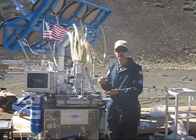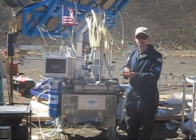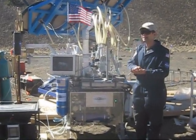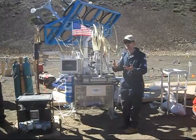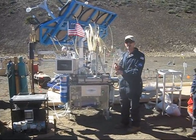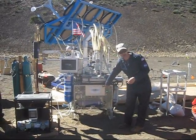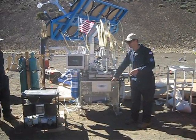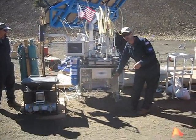We're not just heating the soil — the trick is you need to do that in a methane gas environment. The methane is carbon and hydrogen. When the methane hits a hot enough surface, it cracks back into carbon and hydrogen gas. The carbon goes in and actually strips away the oxygen attached to the minerals in the soil, forming carbon monoxide gas — that's what you see bubbling out of the melt. From there, we take the carbon monoxide and the hydrogen left over from the methane cracking and pump it through a catalyst bed, where we reform methane gas, which gets recycled back into the first step.